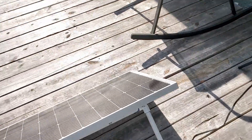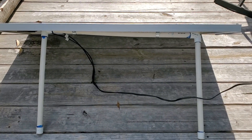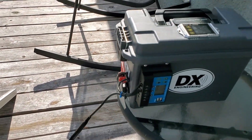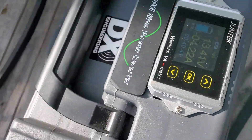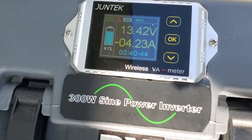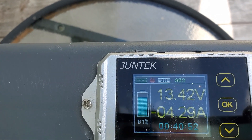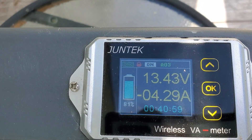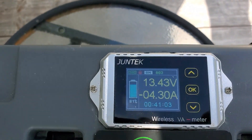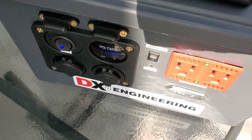Let me step over here — you can see the cord coming off of it. It plugs into the power box here. Right now I'm putting in about 4 amps — the display says negative 4.26. The way I have the shunt wired up, it reads positive current when discharging, but right now at about 80 percent the BMS is managing about four and a half amps going in. The panel itself can put out about seven or eight amps at peak.